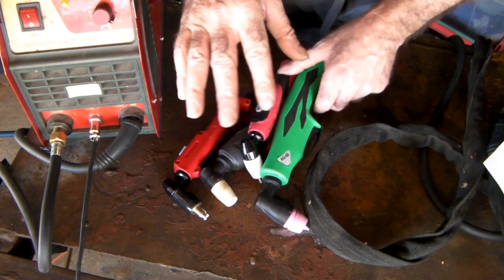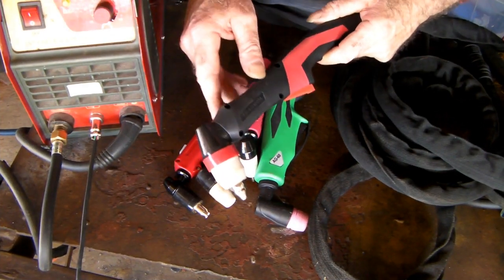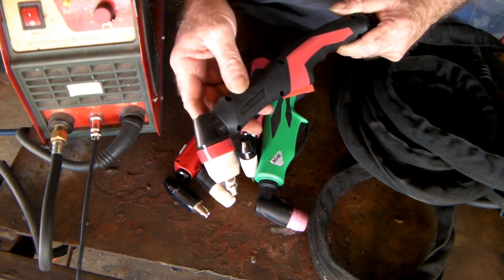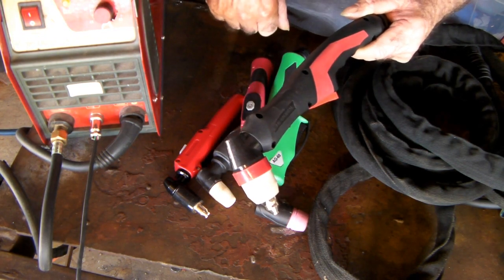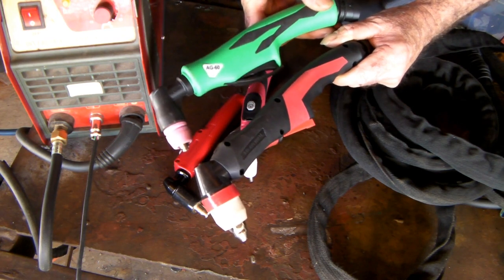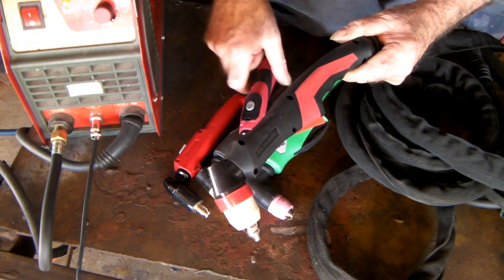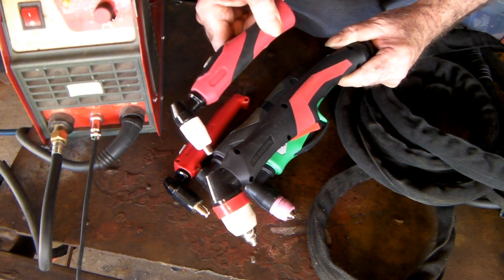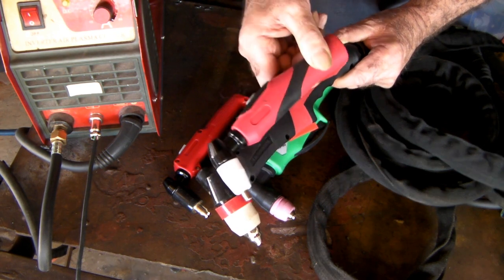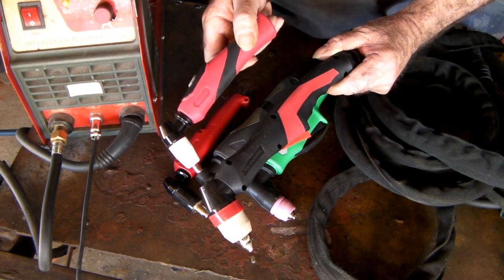So we're sort of half in the middle, but what I want to know is: can we run this little machine with this big sucker torch? This is a P-80, rated between 80 and 100 amps — most people use them on a 100-amp, three-phase machine. So will this torch run on this machine, and what do we learn when we try it? The difference in torch sizes is quite remarkable — there's the 100-amp torch compared to the 60-amp torch, and then if we go down to a PT-31, the size comparison is really different. This is like an industrial three-phase machine torch versus your home workshop thing. But can you put bigger torches on smaller machines? Let's have a go and see what happens.